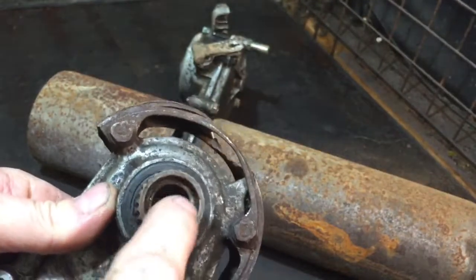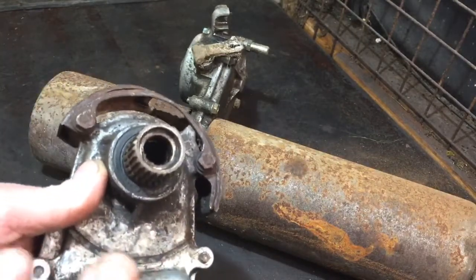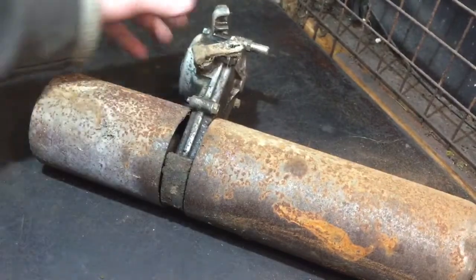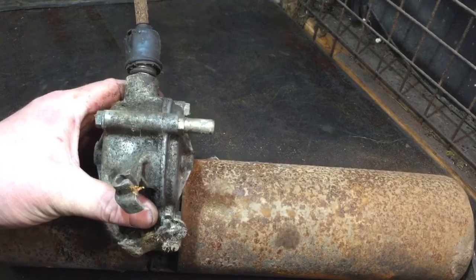There are a few telltale signs — it's been welded there to make a sort of locating bracket. I've worked on these gearboxes a few times and I think this is off of a Lawn Flight. They were different and someone's tried to make it fit. There's play in there — a bit of side to side play. While trying to get it apart I broke the oil seal, so I've decided to forget about this one for now and keep it for spares. I'll work with the other one because that's the proper one.